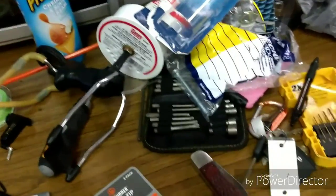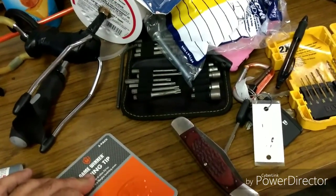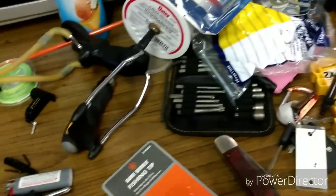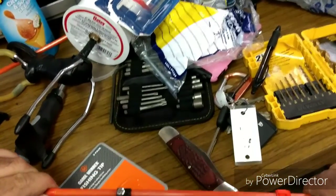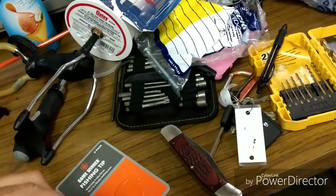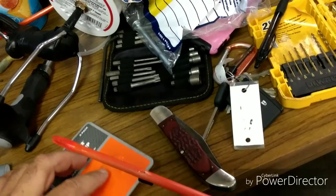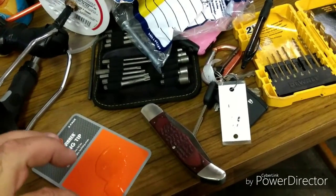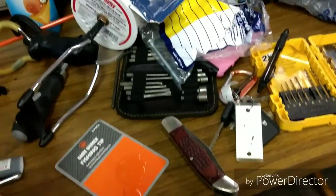This is Loctite 3,500 pound epoxy, and it's a slow setting epoxy. And the reason why I wanted to use a slow set epoxy is because it still stays slightly flexible once it sets up. And we'll smooth that off a little bit, and we'll put a little dab right there where I drilled through the shaft. I didn't want to drill all the way through, but that was my fault. I got a little excited with the drill bit.